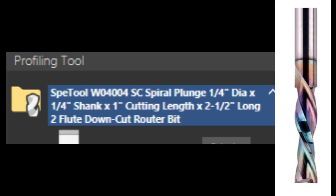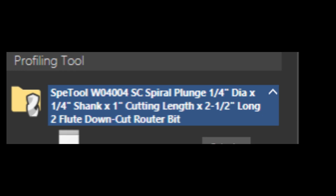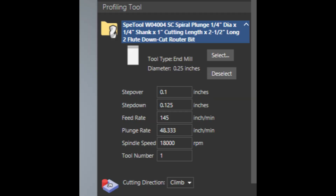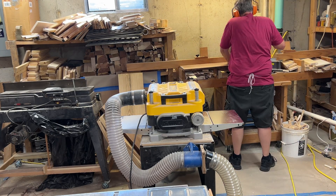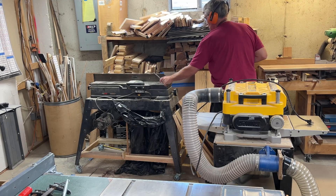This wide board is the walnut. Using the 3/8-inch diameter circles, you can see how close I get the parts together, and when I run the simulation, there's hardly any material left between the segments. I'm using a quarter-inch carbide down-cut cutter. I chose down-cut so it would push the segments down onto the wasteboard, instead of an up-cut which would pull up and they wouldn't stick as well. These feeds and speeds are the standards for hardwood. Now it's time to cut the boards, joint one edge, make sure we have a square end, then plane them to thickness.